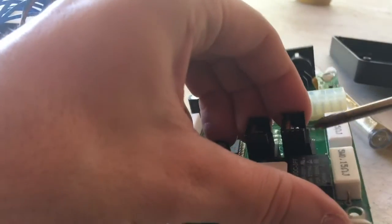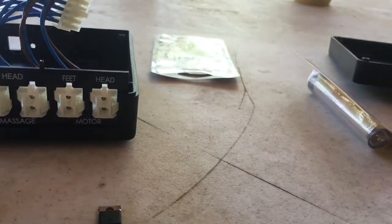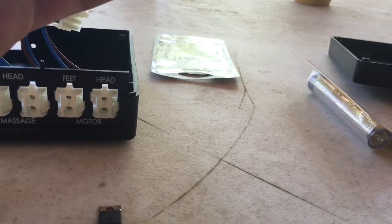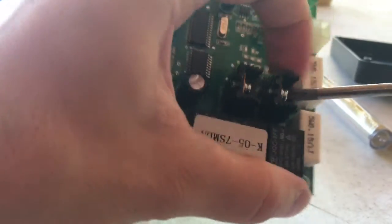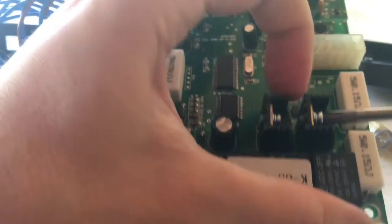And you want to make sure that you're not on a plastic table. I'm going to tell you all about electrostatic discharge. Put it on a wood table. Make sure you have your hand touching on metal. There's going to be a lot of people anal on this video here. I can tell you about that, about potential voltages discharging and whatnot.